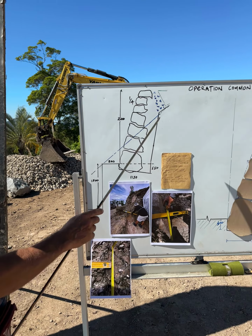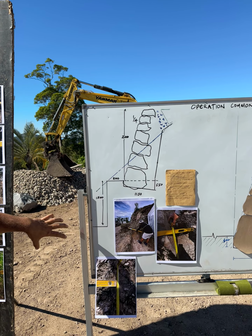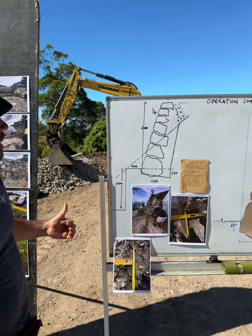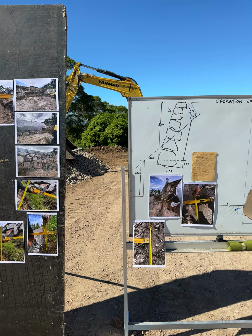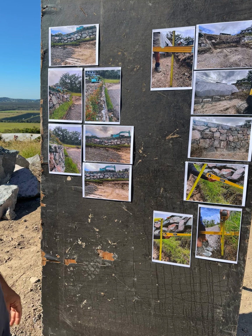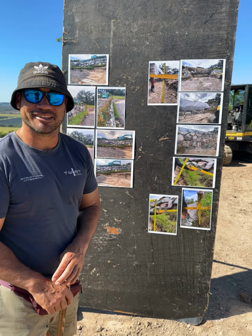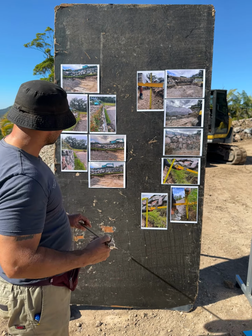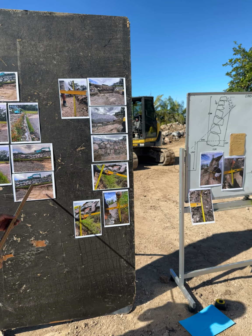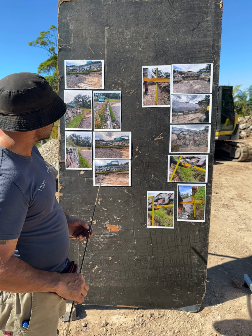And the reason for that, our angle of repose is coming through here, all right, just placing this load through. And as you can see, with some torrential rain, that's what happens, okay? That's what happens. So essentially, in our opinion, a mitigating factor, in fact, the biggest one by a country mile, and anybody who builds anything would totally agree, was this cut here in front of the wall. And as I said, all these levels are still on site. All right, that's the cut.